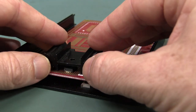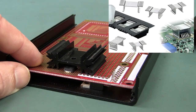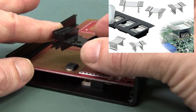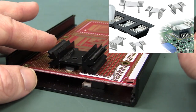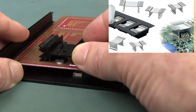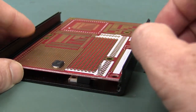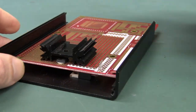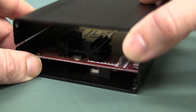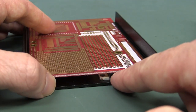You can still use an internal heatsink — you can get surface mount heatsinks that work with pick-and-place machines. They come along and place them down, provided they aren't a huge amount of mass, otherwise they tend to fall off the head of the pick-and-place machine without enough suction to pick them up. But you can get surface mount heatsinks that can be pick-and-placed and reflow soldered. Once again though, you've got all the heat being dissipated inside your case with no forced air through it, because you generally wouldn't have a fan on something this small.